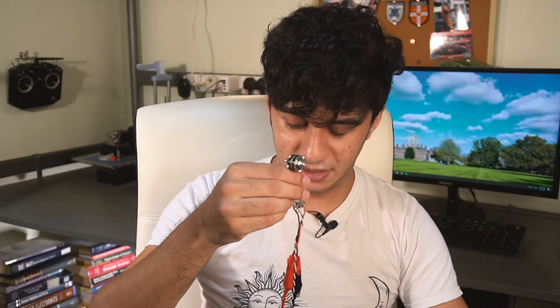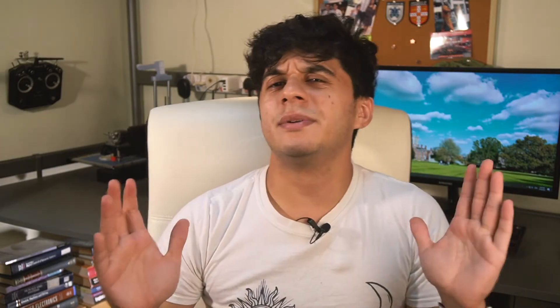Now a 0 throttle value is 48. So let me do that — you'll hear that and your motor should start spinning. That's how you get a BLHeli S ESC to spin using DSHOT.